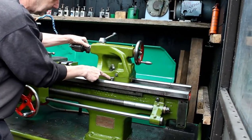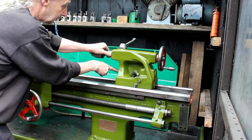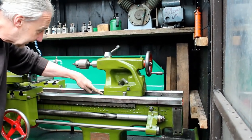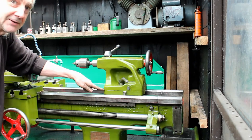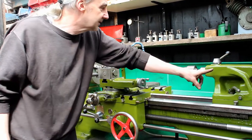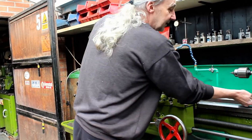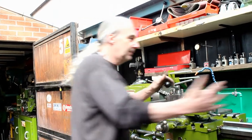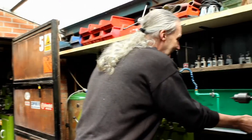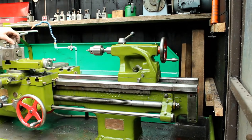My tail stock now has got oiler caps on it - it's nice and slidey with a little groove on each side for the V, and it keeps a constant film of oil. It had worn so I had to shim it. I machined a steel bar to the size of the tail stock, slid it together, and found the shims - a slightly thicker shim at the front because over the years it's worn from people pushing from there. It's now within at least a thou - even a new lathe probably wouldn't get that accurate.